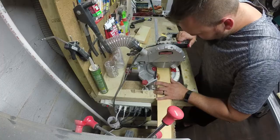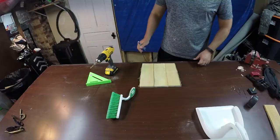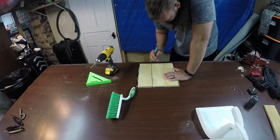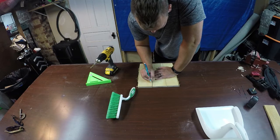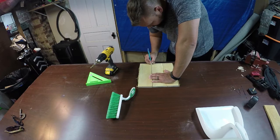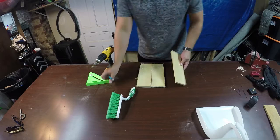Now we can lay them all together about where we want them. We are going to use fluted dowels to join these together, using three in each board, and we can mark on each board where their location is going to be. The location on the board itself doesn't have to be exact but we do want to make sure both boards get marked so the dowels line up perfectly after we drill and install them. Make sure you mark the boards A and B so you know which board goes to which. With the jig we're going to need a square line straight across where we made our marks.